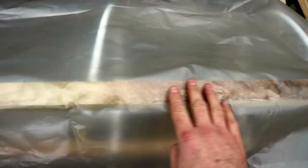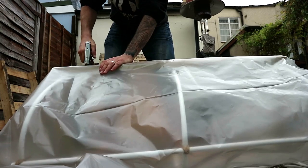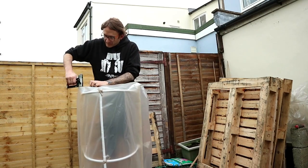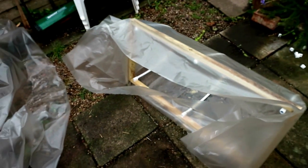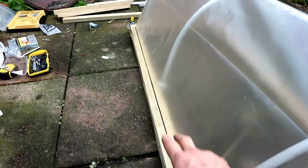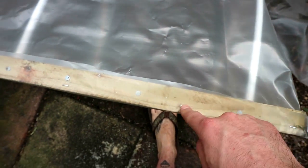I've got the polythene sheeting lined up more or less where it needs to be and I'm going to put a staple in every so often. Once you've stapled it all the way around — I had to fold it over at the corners so it doesn't bunch up — I won't trim that off just yet. First I'll get the outer frame put on, and then I'll trim all the excess. You can see why I put this here — it neatens up the edge and you can use it to fold the polythene over and secure it again with a staple gun.